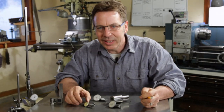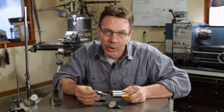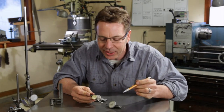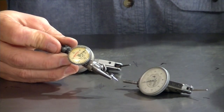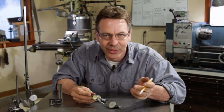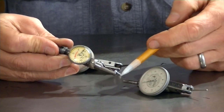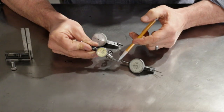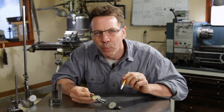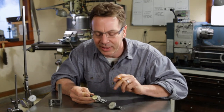A test indicator excels at reading inside measurements, or getting into unique positions where a dial indicator can't get to. Here is the first one we're going to look at — this is really the grandfather of test indicators, the Starrett Last Word indicator. It has similar things to the dial indicator: the bezel rotates, it has a needle inside. But where it's different is how this probe is actually used. It only moves a little bit and it pivots right here. It can only move a travel of about twenty thousandths of an inch, whereas a dial indicator can move about one inch, some up to three or four inches. They can do a lot with that linear travel, but they can't get inside a hole as easily.